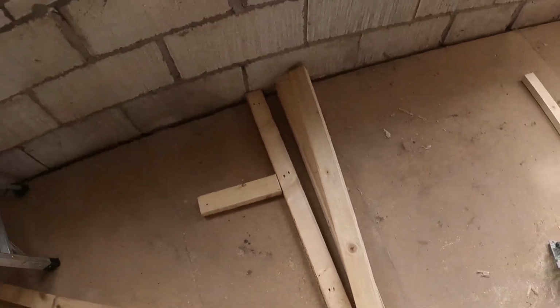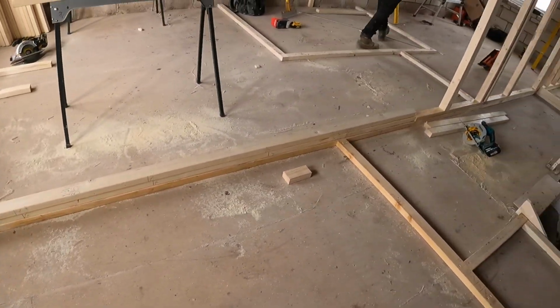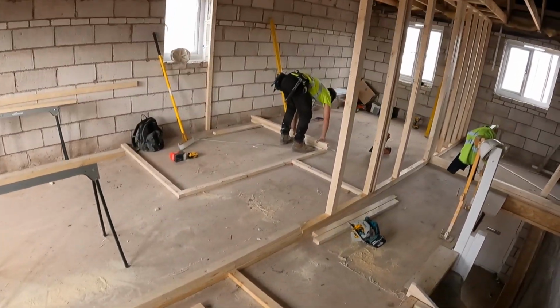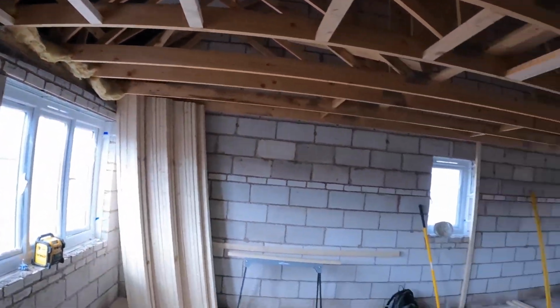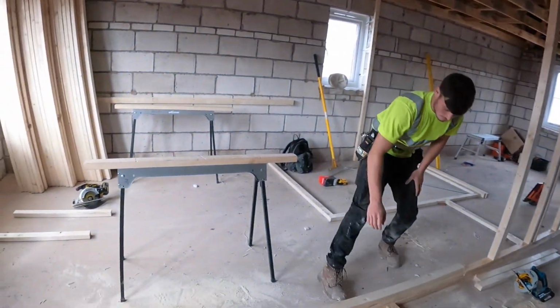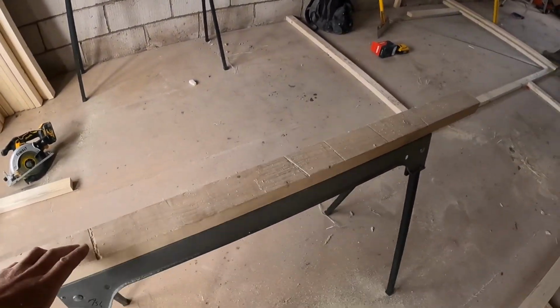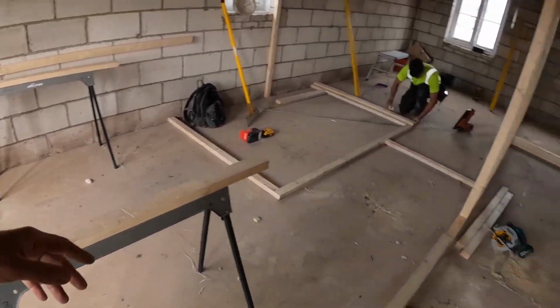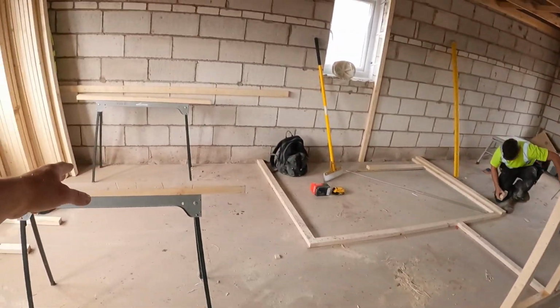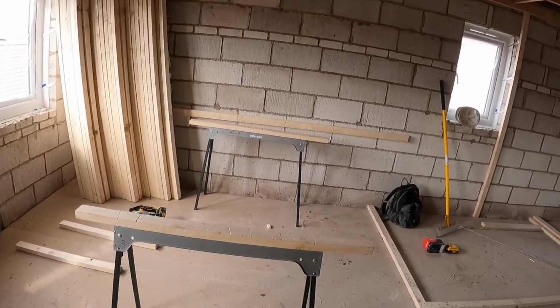It's too tight. Oh dear. And now I've got it like that. I'll go along, mark the leg. One leg I'll mark it against the catch nogs and just go to the smallest one, and then cut them all the same, and I'll cut them on the trestles that we've got set up. Just screw these bits of timber on them just so I can get more legs on it. Like this wall here, it's got 17 legs, so it'll fit on there, and I'll just nail the timber to the wall there just to keep them all the same.